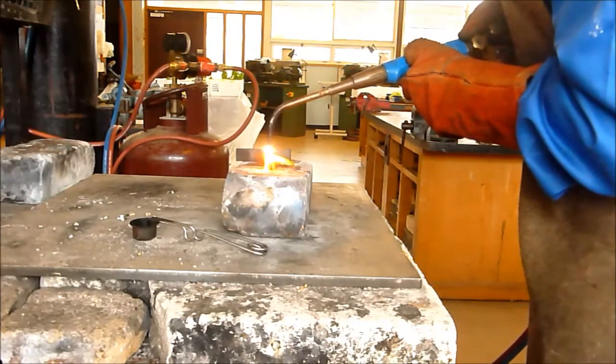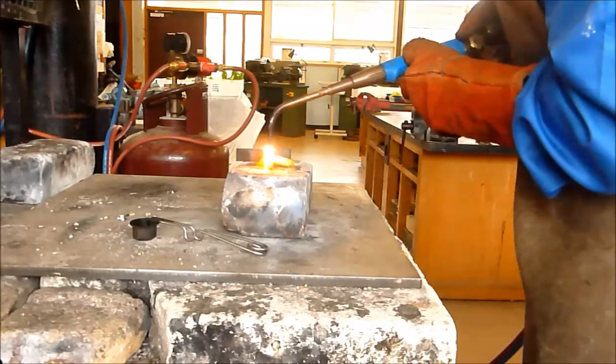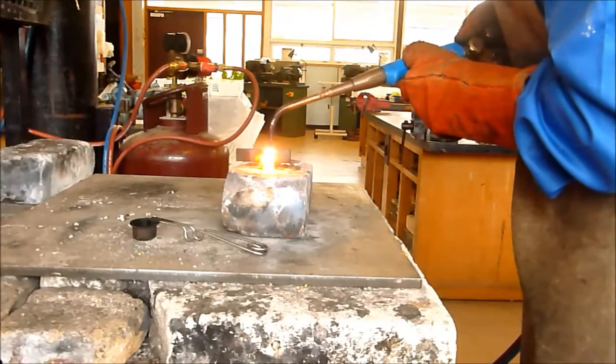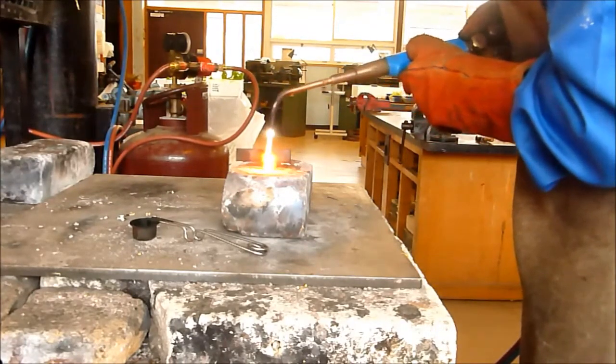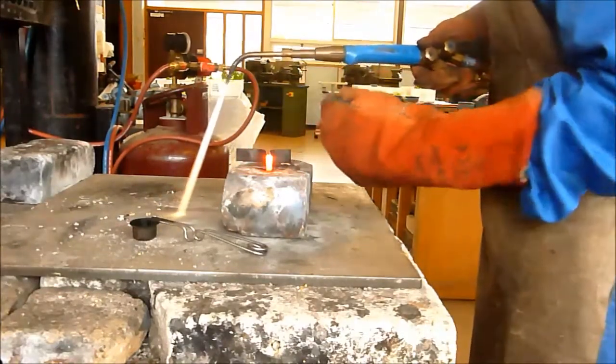Just wait, and as soon as it's molten you can give your torch a little bit of a wiggle — it helps the steel push around and join together. Wait and you'll watch a little bridge join between the two bits of steel. There we go — now it's joined. It's important to do that at both ends of your steel to hold them together.